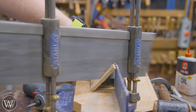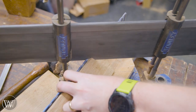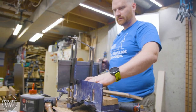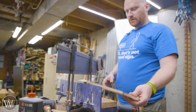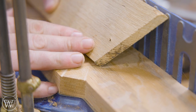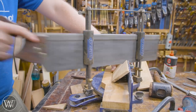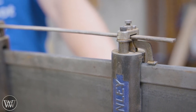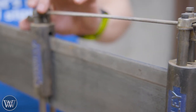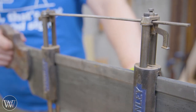The fence is actually set up to cut at a pentagonal angle. This particular one is set up so you choose the number of sides you want in the frame and cut it — it doesn't give you actual degrees. It says one, two, four, six, eight, ten, twelve. So I have it set on five and it cuts pentagons, which is kind of cool. They did this back before there was a lot of math in school so someone could just cut it. I need a frame that has six sides, so I set it on six and we cut. I put a mark on the bed so I always came to the same place. The pieces came out really, really close — well within tolerances.